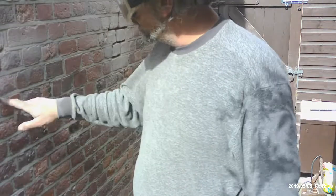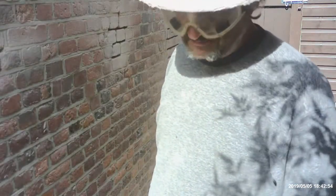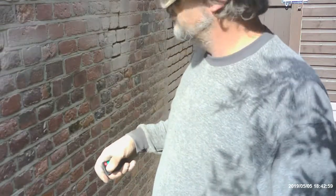Inspection of the wall. Pretty much most of this is separated from the brickwork, so we're going to just grind out layers at a time. We're going to take about three rows of bricks at a time, grind it out, and then rake it out, and then go up three and just keep going. And there's a wire up there. I'm going to stop around about there today, just get it raked out, and then we're going to have a tidy up and a blast off with some mortar, and I'll show you what you pull out of the wall with the lime mortar and when to stop.